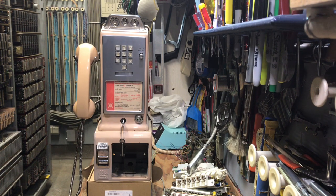I have a monitor speaker connected to the line, and this is a coin-first payphone which is connected to a ground start phone line. When you go off-hook, you do not receive dial tone until there is a coin deposit. This phone is set up for 10-cent operation, so you must deposit at least 10 cents to get dial tone.